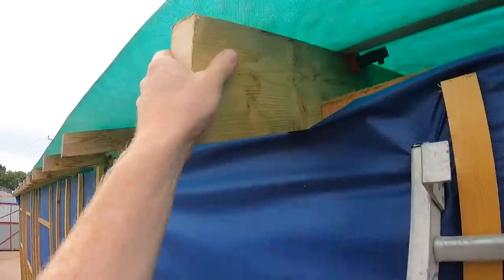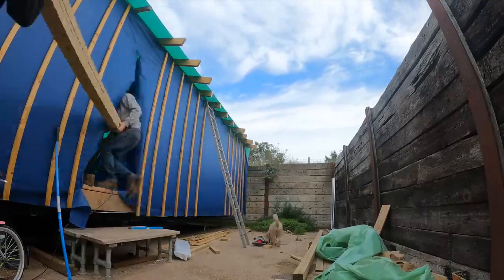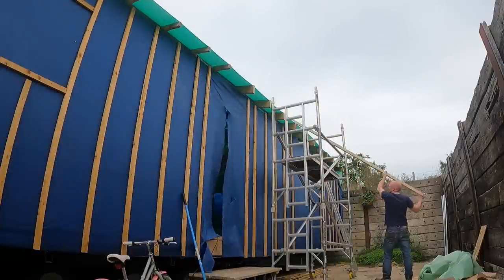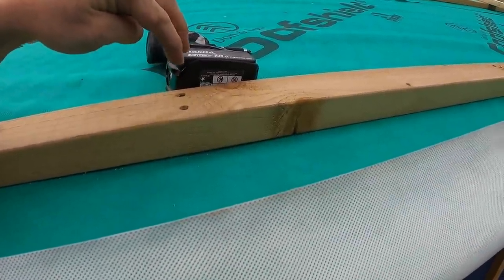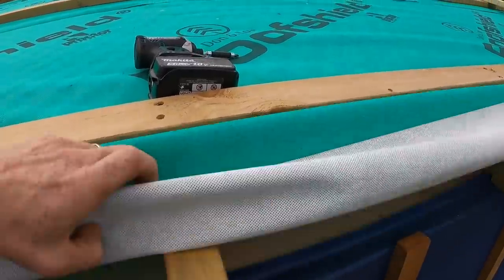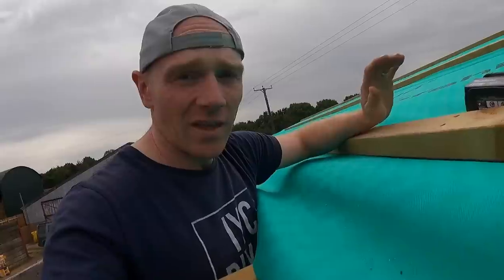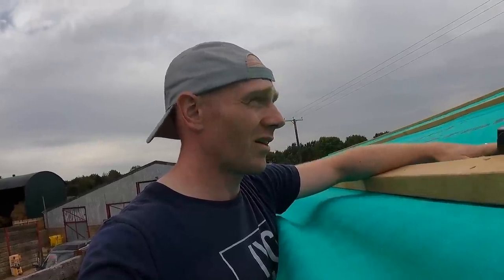So I've straightened out all of these rafters. I got one all plumbed up and then I clamped and turned the others to make sure they're all nice and plumb that way — they were just a twisted bunch I think. Then running 200mm screws down through each purlin into the rafters, so that should hold them more plumb as well. That just avoids the need to put any blocking between them on the way up because if we do that we get cold spots and cold bridging, so that's worked out okay.